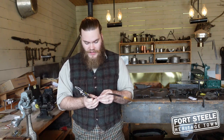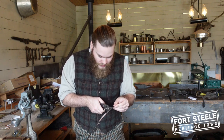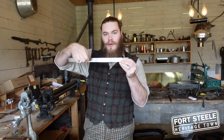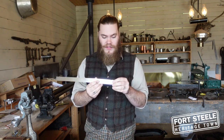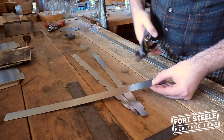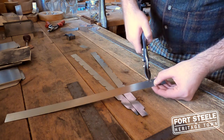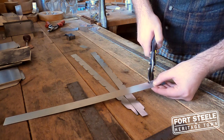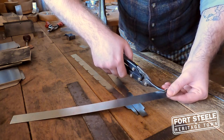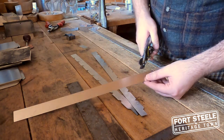Taking my tin snips, I'm going to make a cut directly down the middle of the little markings of our segments, but not going past that top line that we scored all the way across, giving us a little mark like this. Once we've done that, I'm going to take my tin snips at approximately a 45-degree angle to that little snip, cutting just down to the line, and I'll repeat that process all the way down.